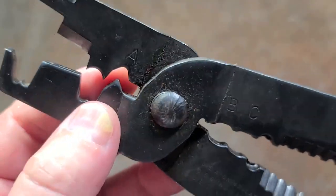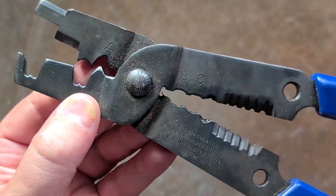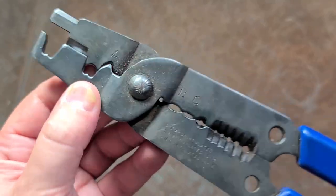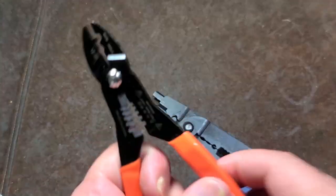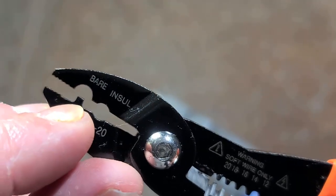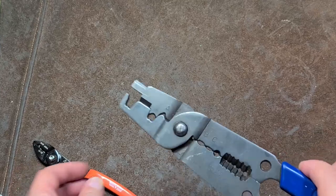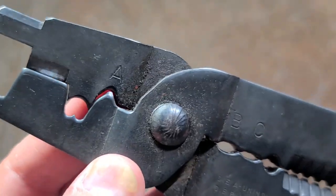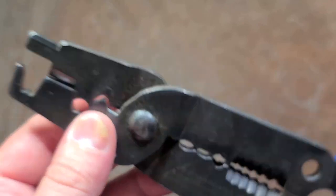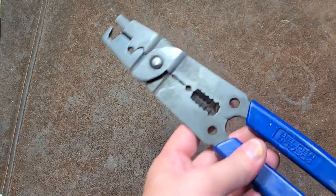The reason I mentioned this tooth is that it's actually for small or uninsulated terminals. It's a pretty nice shape and design. Most crimpers for uninsulated terminals just have a kind of square tooth and then just a half round, but this one really is a bit different - it just has a bit better shape, with a bit more careful attention paid to that.